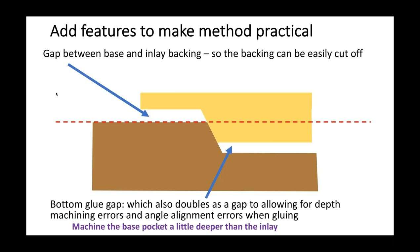To do that, we just add what's called flat depth in the V-carve. We did a start depth before that determines the thickness of the inlay. If you add some flat depth, that just adds a little bit of gap between the inlay and the backing material. I'll repeat that again in a little while, so if that doesn't make sense yet, hopefully it'll help.